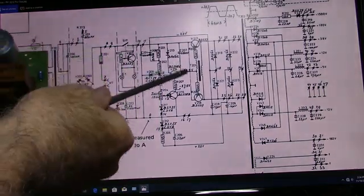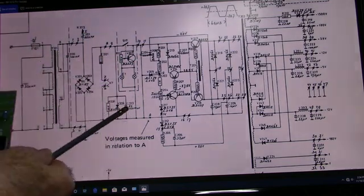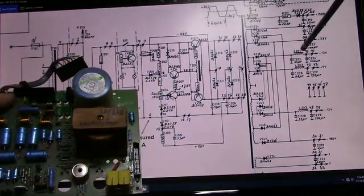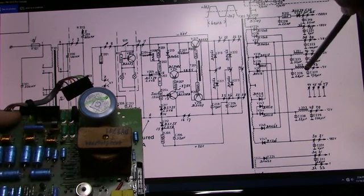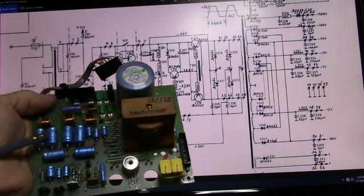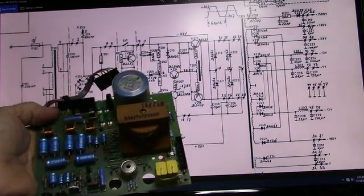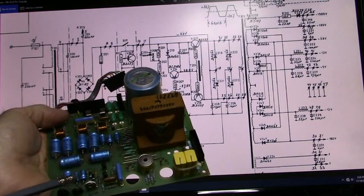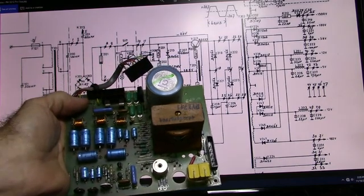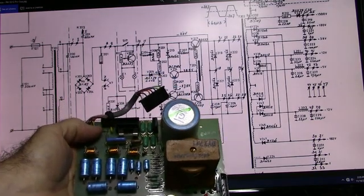Anyway, this is the schematic here, and this is your main capacitor, which is here. Some other things, you've got some inductors here, and these three outputs have a pi filter, which is here. I'm going to check all these capacitors too. The fuse is good here, so hopefully they just opened and didn't burn anything. I don't see any sign of burnt components on here. These are the two stabilizers. They look like diodes. They're basically just for voltage reference and temperature stability too.